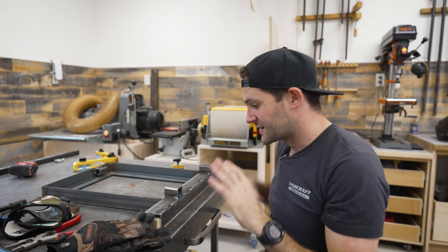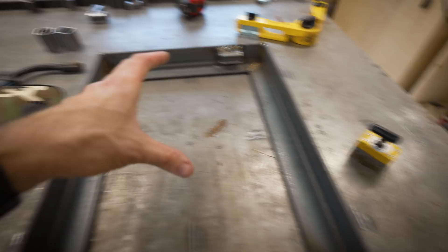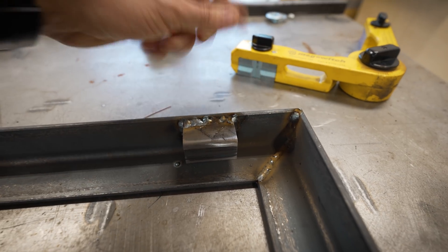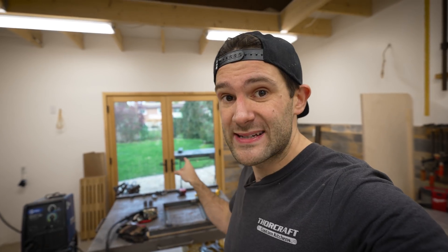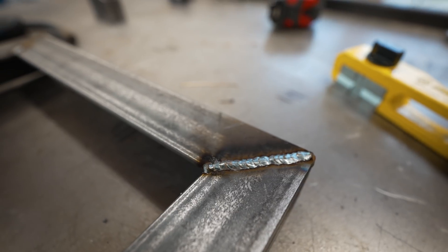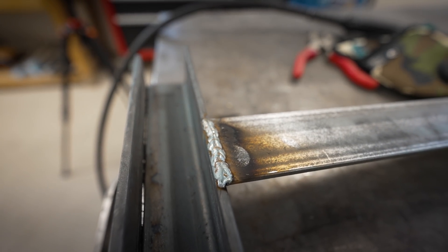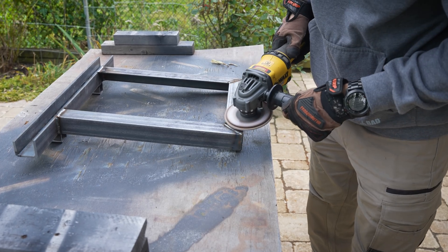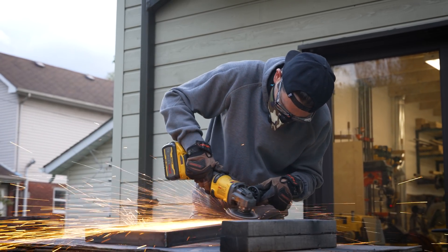This is now starting to look like a genuine TV stand. So let me show you a couple of things I did here. You have the two main pillars — I'm going to drill some holes in these and that's where the TV is going to mount. Up top I have this block where I'll drill a hole to mount my microphone. And down here at the bottom I have these two little loops for cable management. Now comes the part where if you're bad at welding you're probably going to spend the majority of your time — we're going to take this stand outside and grind down all the welds until they look nice. The only difference between an ugly weld and a nice weld is a little — or a lot — of grinding. Just toss a flap disc on your angle grinder and go to town. And as you can see, while grinding I also put on my RZ mask to keep my lungs safe from all those little metal bits.